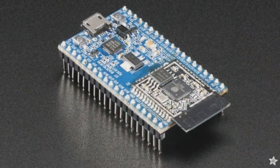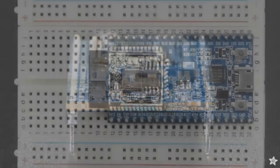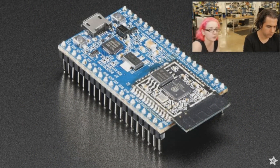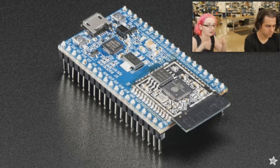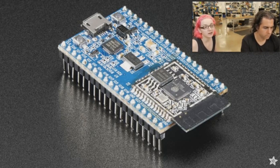Next up — what a lot of folks were waiting for this week. It's here: the ESP32. This is the dev edition. The ESP32 is the successor to the ESP8266. The 8266 is a very popular Wi-Fi microcontroller which, after a lot of effort by talented engineers, got support for programming in Lua, MicroPython, and Arduino — Arduino being by far the most popular. It's very inexpensive. But the ESP8266 didn't have a lot of pins, didn't have many ADC pins, and a lot of pins were taken up by bootstrapping requirements at boot.